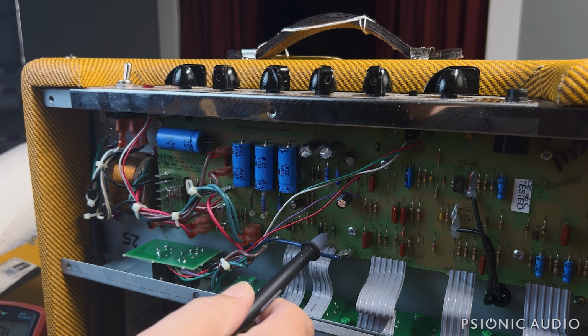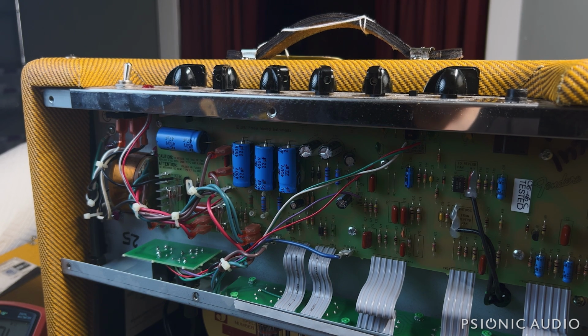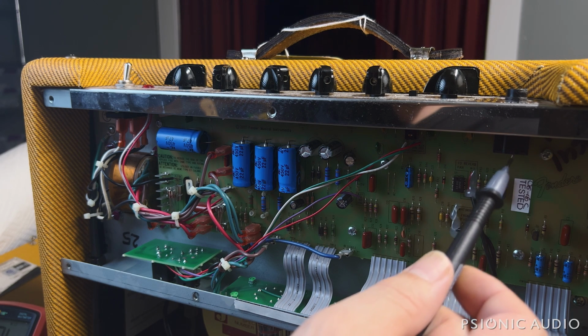These screen grids are the ones that I worry about. They're 100 ohm half watts, and that should really be both a 1 or 2 watt resistor and a much larger value than 100 ohms. I will talk to the owner about letting me bump those up when I have the board pulled out to get to this jack, because that's just 2 resistors and it's easily done.